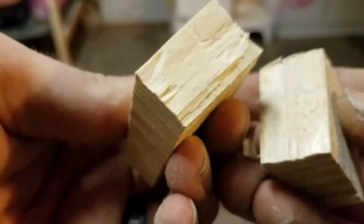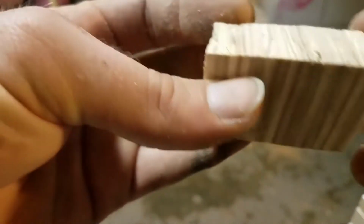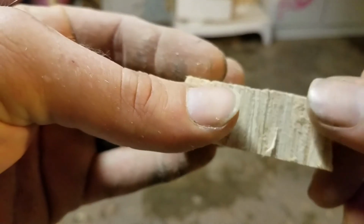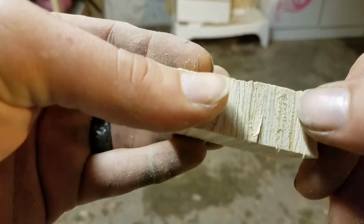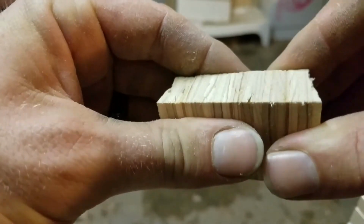Okay, here I'm going to have to make a little bit of a design pivot. Something came up when I was playing with some of the offcut from the plywood, and I think this is going to be necessary to be able to make sure this countertop stays together when we're actually using it. Okay, so let me explain what I'm saying here. This plywood is construction grade, like what you get at Home Depot. The problem with that is that the plies are not always adhered very well. As you see, it cracked between the plies, not on my bond line. So I had to come up with something to fix that.